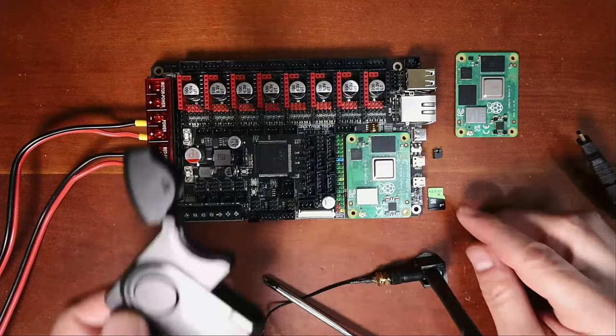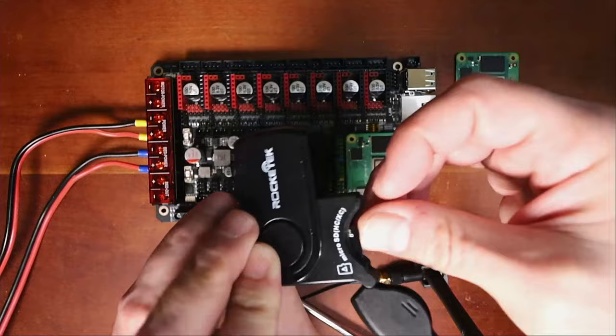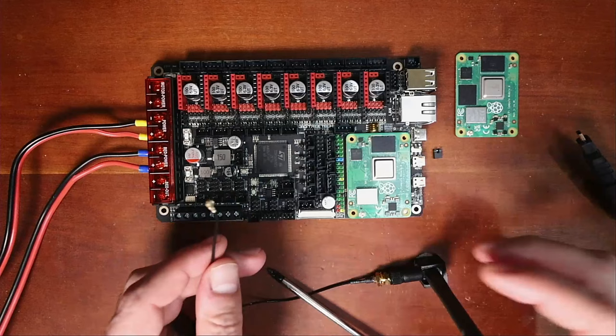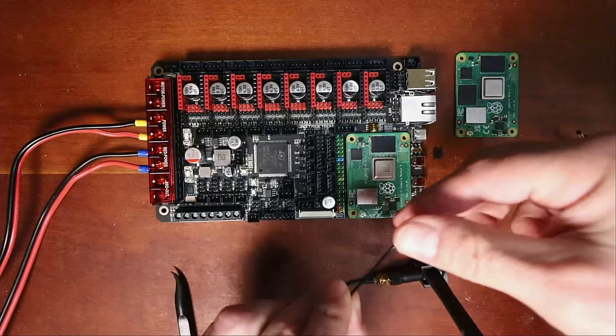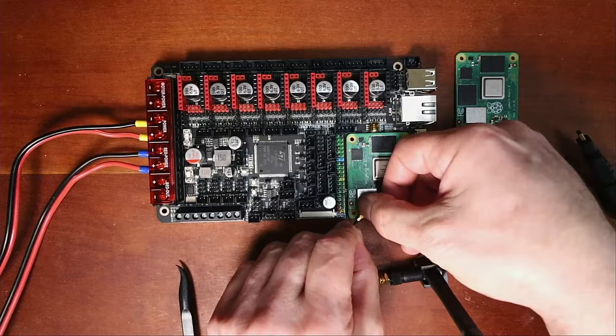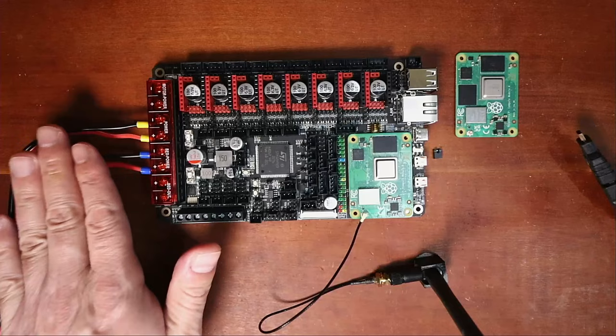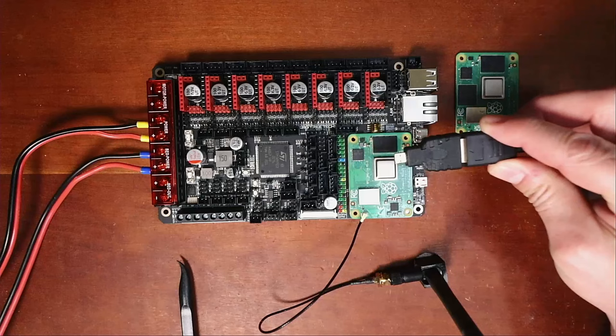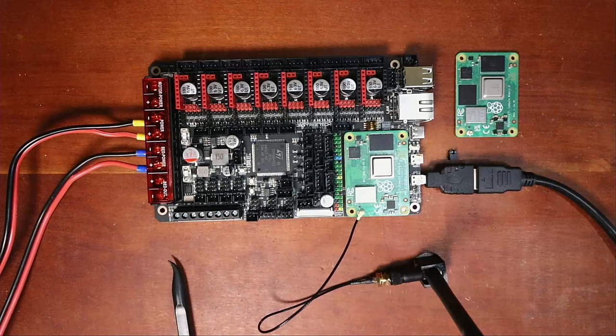Keep in mind I've done this a couple of times so it's going to pop an error message — normally you won't see that on a fresh SD card. Let me plug this in; you'll hear a beep. I'm going to connect the actual Wi-Fi antenna right here — there's a little cup on the bottom that goes into this little port, so you align it, push down, and that's connected. I'm going to power it with PSU power because the five volts is not enough, and I'll connect the HDMI cable so we can see what's occurring.